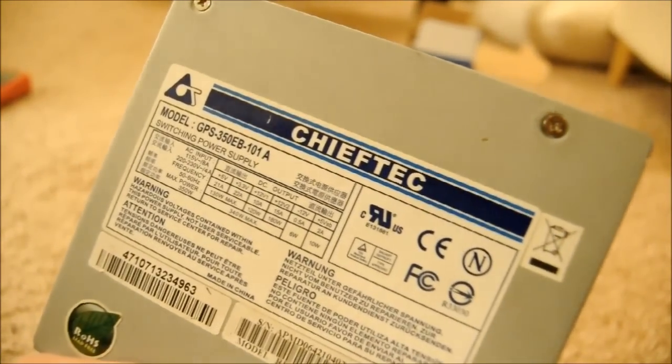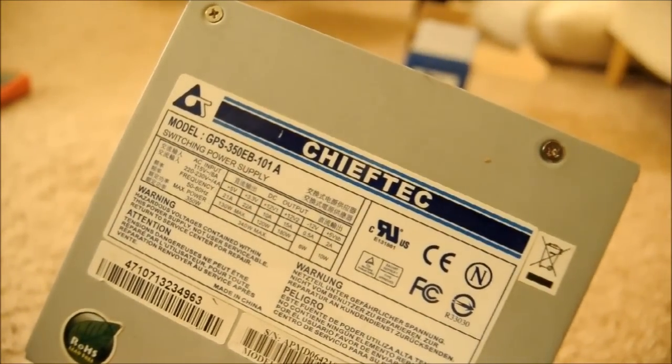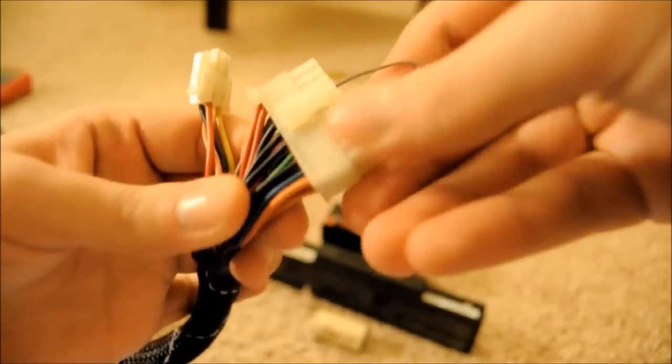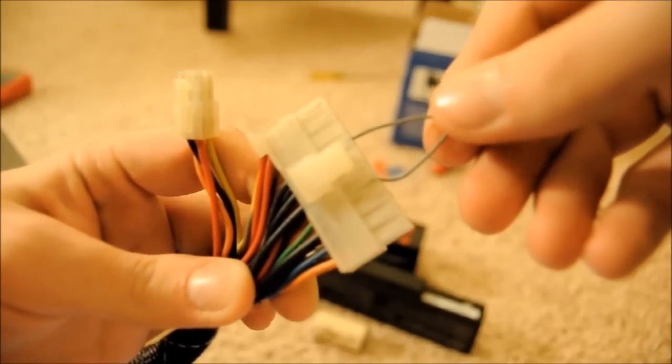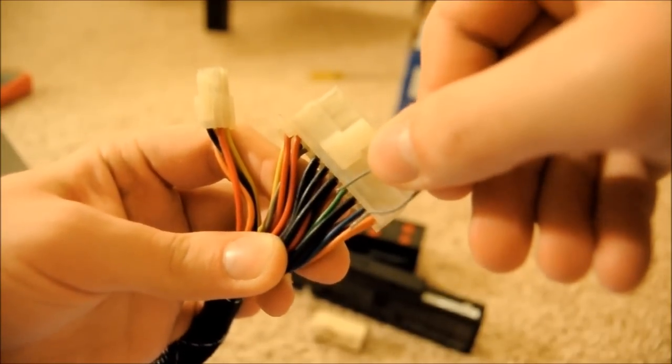If you decide to use a computer power supply, pick one with at least a 10 amp rating on the 12 volt rail. Do not connect the compressor with the power supply on. First connect, then fire up. If it shuts off, then use the second 12 volt rail, which will probably have a higher amp rating.